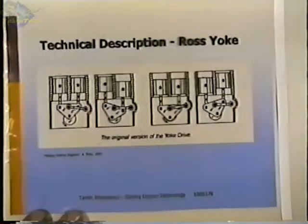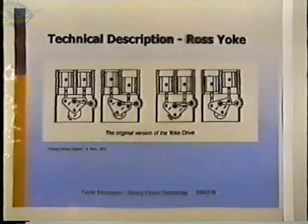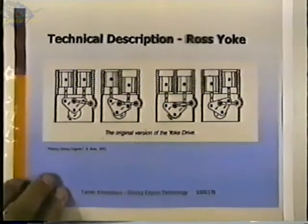This mechanism is called Ross yoke, and in this engine, it's showing how you can convert the rotary motion of the crankshaft here to nearly linear motion on the compressor or the displacer and the power piston with this triangular piece and a link that keeps the triangular piece in position. And as the crank rotates, this triangular piece translates up and down, but it also rotates at the same time. And as it rotates, it moves these connecting rods and pistons up and down, and operates the engine in the proper phase.